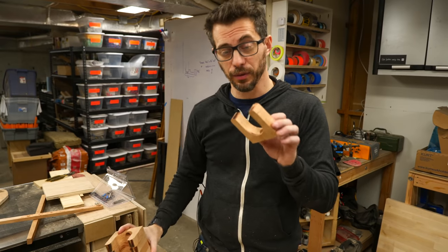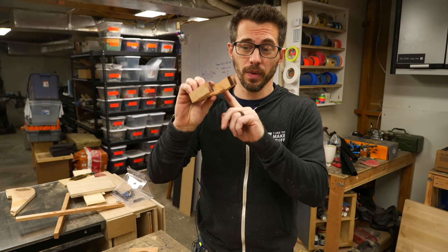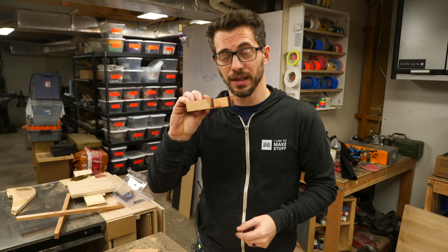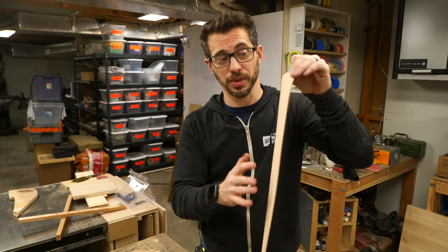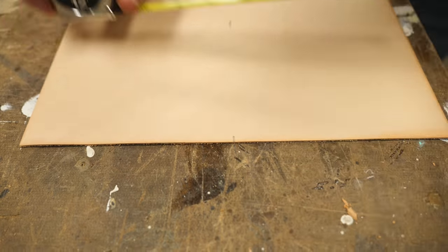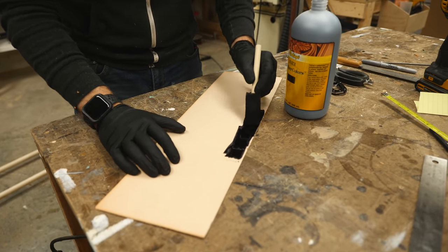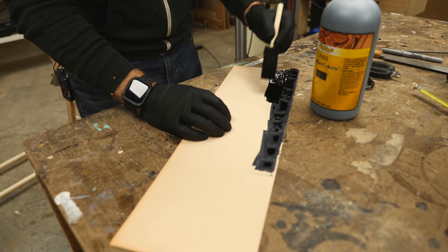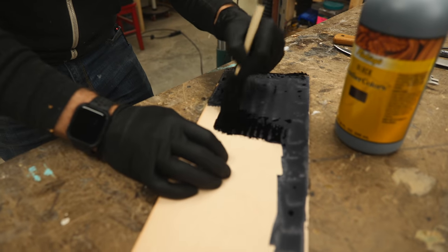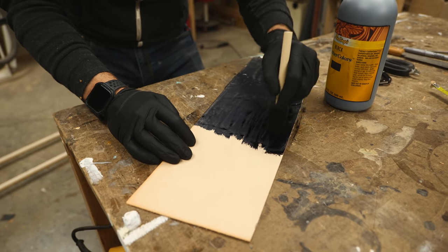I got all six of these holders done. I mentioned earlier that cherry burns really easily — just by rounding these over on the sander it burned all the edges. Luckily that doesn't really matter because I want to coat this entire surface inside and out with leather — not the top and bottom, just the area where the guitar is going to come in and sit against. I've got a really thin piece of leather that's going to be easy to wrap around that shape, so I'm going to add some black dye to this, cut it into strips, and then glue it on with barge cement. The reason I'm using leather instead of foam is that apparently certain types of foam will break down the finish of certain guitars — leather seems to be safe, so we're going to go with that.